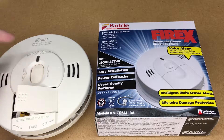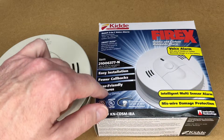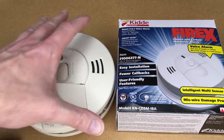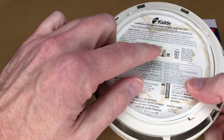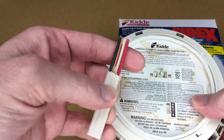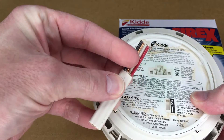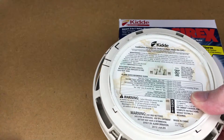I'm going to be replacing this one and I'll also take a look at the old one on the inside. If you're interested in one of these I'll put a link in the description — using it helps me out a little bit at no extra cost to you. These are approximately the same type of smoke detector; they're both Kidde and both wired units. They have three connectors on the back, wired into the house with 14-3 wire. You have a hot, ground, common, and then the red wire is a communication wire so that if one detector goes off it'll set all of them off.